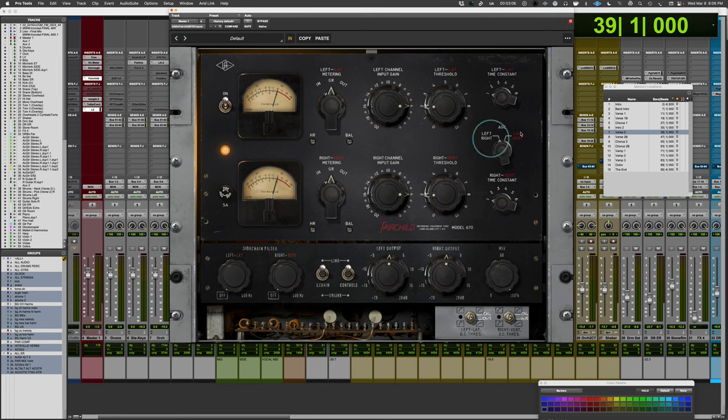We can go through all of that, but that's all in the manual if you're interested. This will operate in stereo left-right mode, or it'll operate in lateral vertical mode, which is the mode it was set up for, being used as a limiter for the front end of a cutting lathe for cutting vinyl and/or cutting lacquer. And so it's very effective with that. More or less what you're getting with the lateral vertical is mid-channel, side channel, so basically MS in translation.